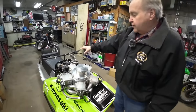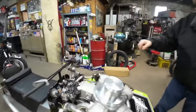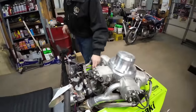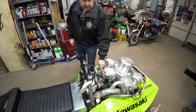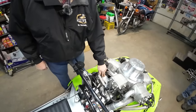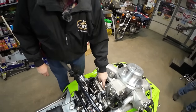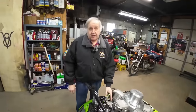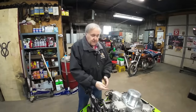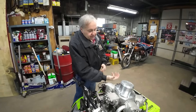No, the fuel comes through the carburetor into the intake manifold. I can show you that, but a lot of it's covered up. This is the intake manifold for the supercharger. So it goes down around. The supercharger is underneath here. It's off of a 2.3 Mercedes, and that forces all the air and fuel into the crankcase from below.